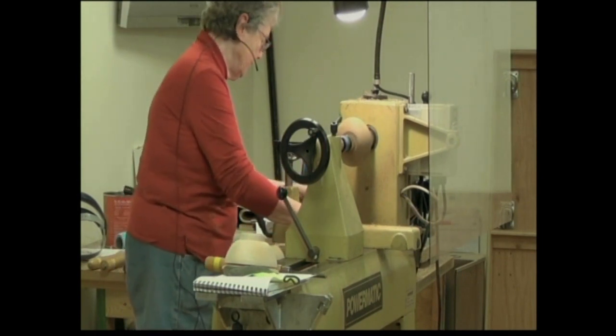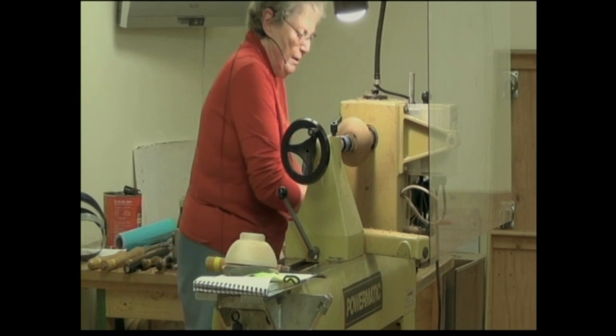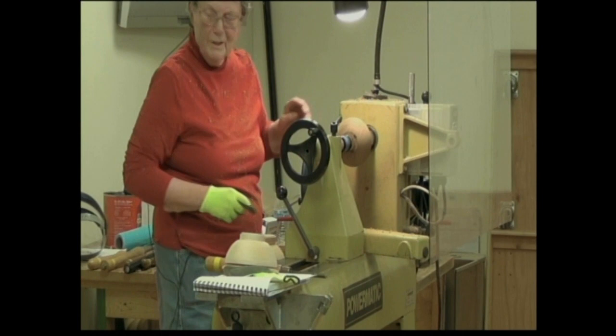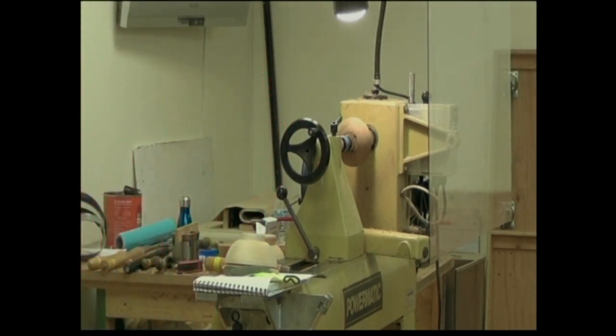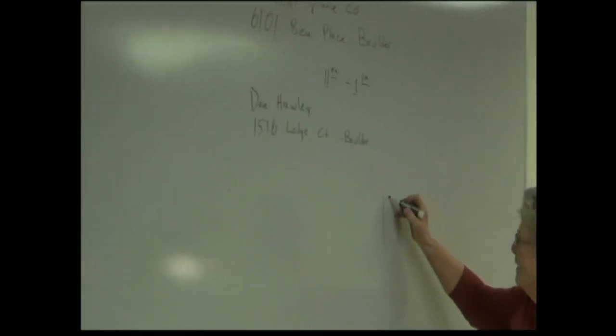So then I would just come in with another little half-inch by quarter-inch scraper. I can draw it here. Here's the tool handle, and what I did is cut on the grinder a little bit like that. That's what's nice about having cheap tools, because if you mess up, you don't care. With that, I can really get down, hollow out that inside, and then just hand finish the little nub. Sometimes I now carve a lotus leaf flower in the bottom, and it looks pretty nice.